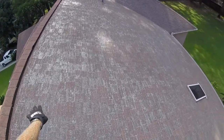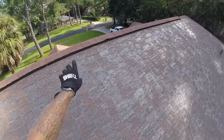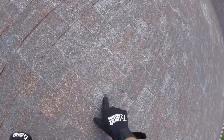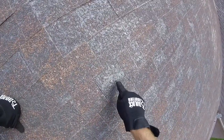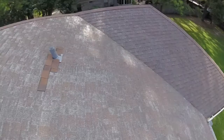It's worse up here towards the ridge, where you're seeing that interior stain around the ceiling fan. And here's a nail backing out right here — it literally just came right out. So I'm going to go down to the truck and get something to cover that hole. But yeah, we're beyond a repair on this roof. This thing is too burnt up; there's no way to salvage this.